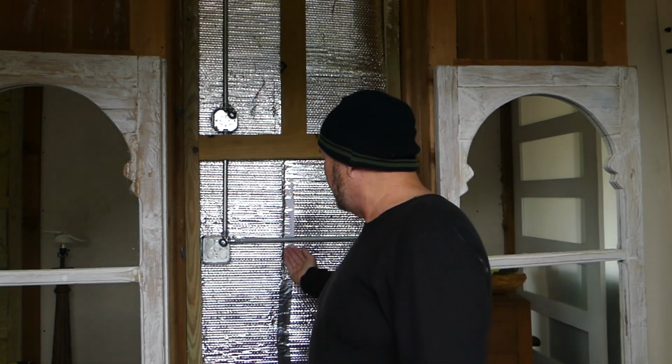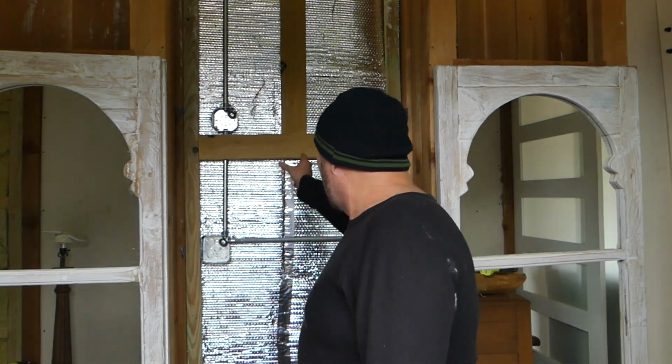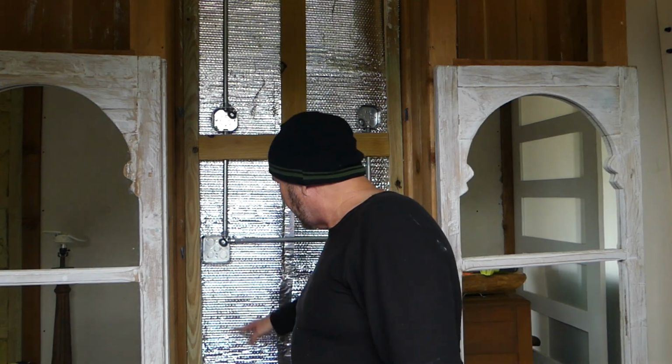Stop bossing. Boy, internet. You know, while I'm doing busy work of putting a lot of supports behind everything, I'm going to go ahead and run the rest of the supports in case somebody changes the way the piping's going to be. Now I'm going to come up through a suspended sink, so I will want something here. So I'll run another 2x4 down and then a couple of different 2x4s across so that somebody can attach different plumbing in the future. So let me go ahead and do that as well.